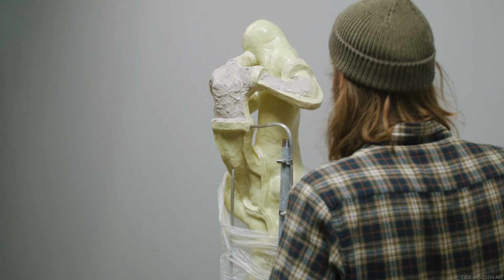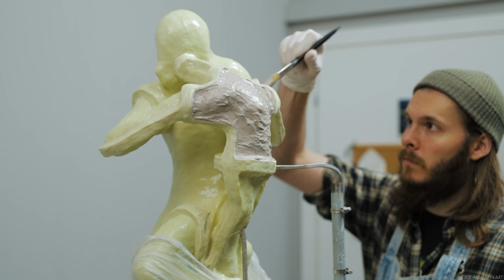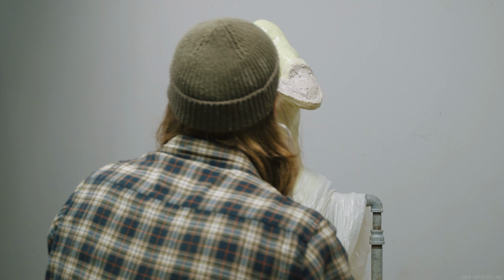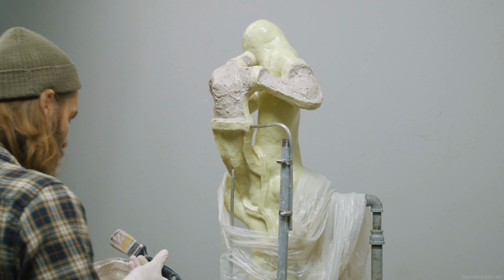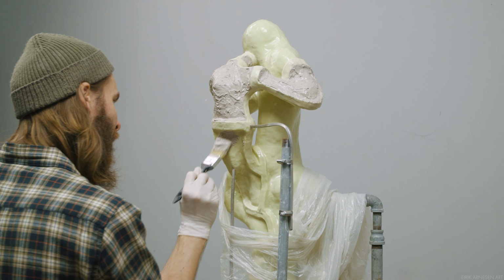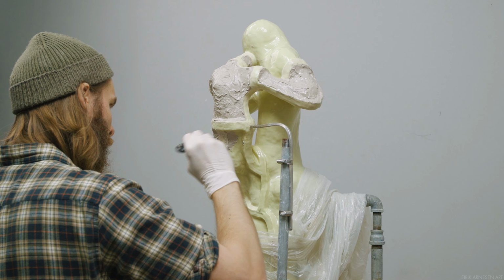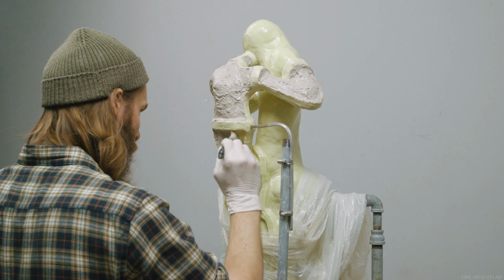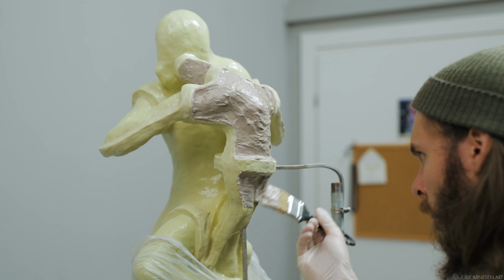The reason we don't just go straight into the fiberglass and I do this splash coat to begin with is because I like to capture the detail of my silicone on the inside of the mother mold so that the two registers really well to each other. You certainly could go straight into fiberglass without any first layer covering the surface, and the mold would most likely be just fine. The first layer is just an extra precaution that I take because I'm, well, a little bit extra careful.